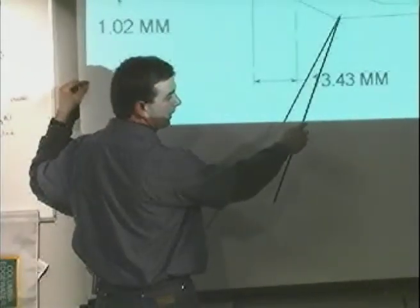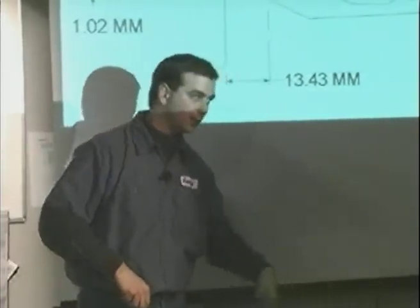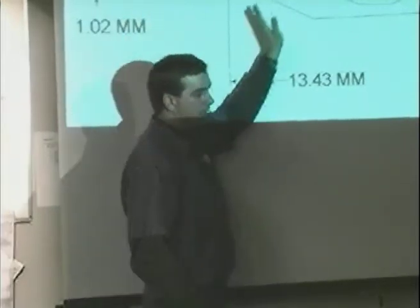That's going to move this bed knife really close to the center line and I'm not going to have a very aggressive raking. My raking is not going to take place — I'm not going to reach into the grass and lift it up.